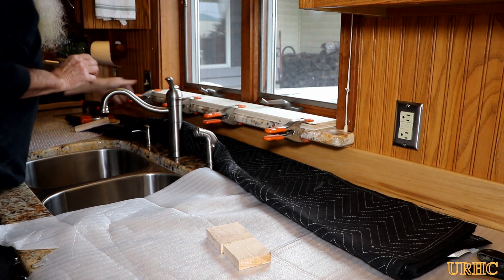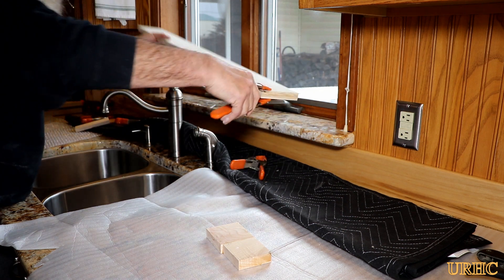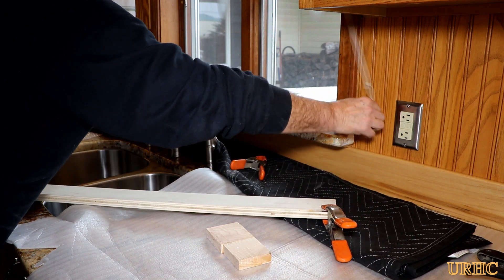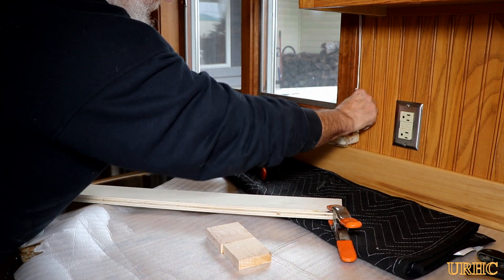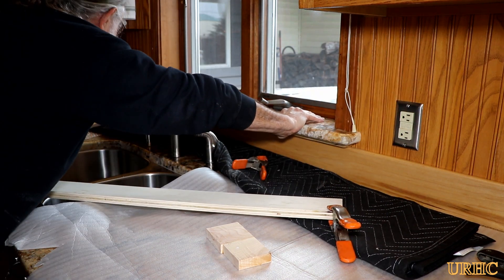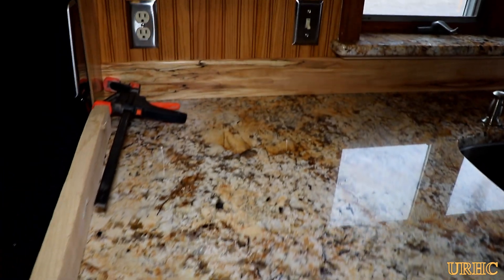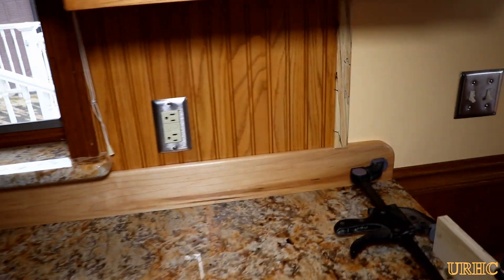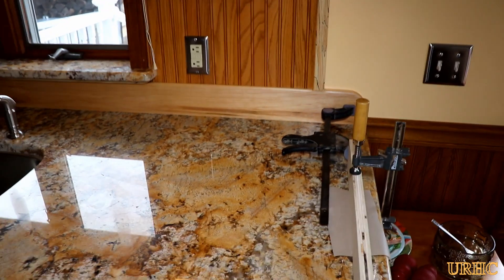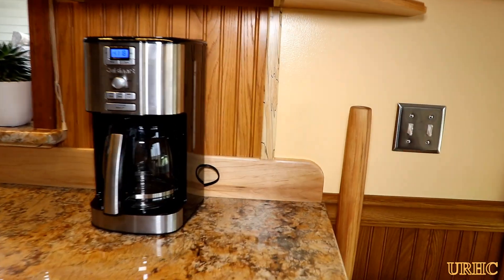I'm really happy I had them make that little piece of window sill — it's a little extra touch that really shows. It'll look better once I find a window without that center strip, probably some type of awning window. There are the clamps and plywood I used just to support it safely when handling. Now the wainscot and everything is glued on and in place. I still have to leave those clamps on for 24 hours until the glue is really good and dry so nothing moves later.